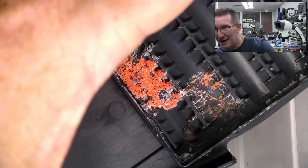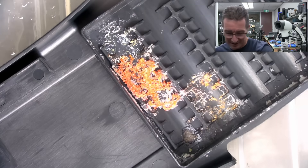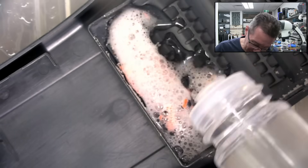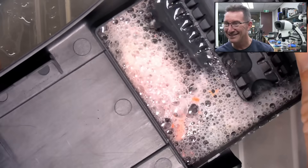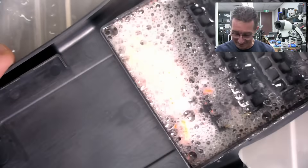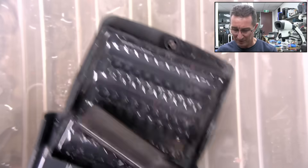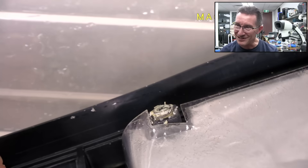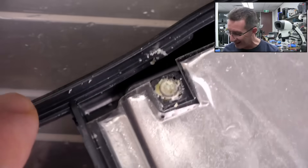Let's see if we can put some vinegar on that. It's that reddish colour under the lights. Let's see what happens if I actually get some vinegar on that. Wooo, ha ha ha! Look at that — oh geez, that's fun! Look at that! Good stuff. That vinegar's going to town there, isn't it? Hours of fun for the whole family. Give it a scrub scrub and that battery compartment will be good to go again. After cleaning up, this contact here is actually stuck down flush — this was supposed to be the spring contact, which is like that one. It was completely stuck down flat, and then I just lifted it up and it just popped out of there.